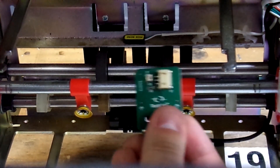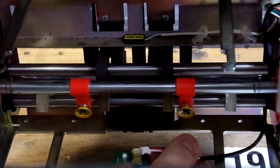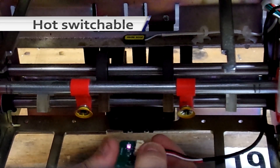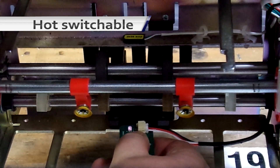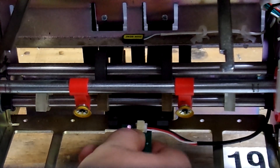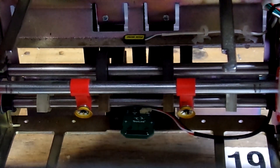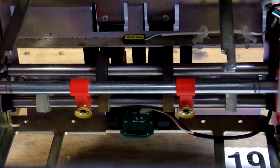Take your new low note sensor, plug it in while it's outside of the housing, just like so, and then insert it into the housing like so. I haven't had to turn off the ATM at all. I've replaced the low note sensor in less than 30 seconds and now you have a new and working low note sensor ready to go.